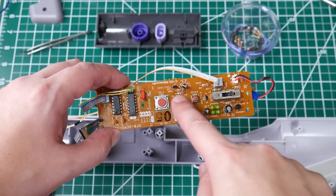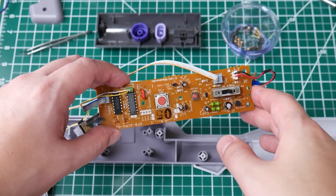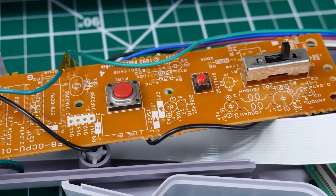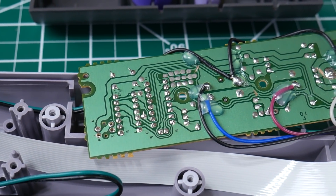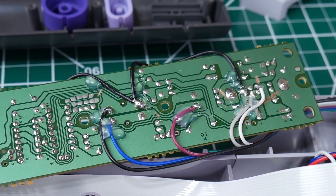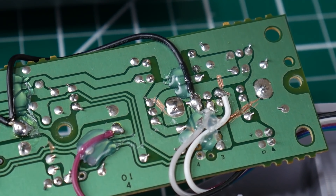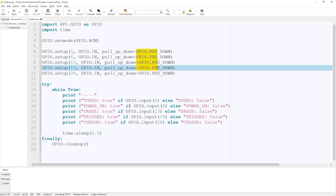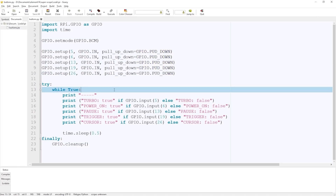With our LEDs, camera, Raspberry Pi, video sync processing, and Bluetooth all working, let's work on the gun's buttons next. There are three buttons and one three-position switch wired to this board, but we don't need the other components — we'll remove everything extra. We're going to use five GPIO pins on the Pi, with five wires connected to one leg of each button or switch. The other legs will be connected together and tied to 3.3 volts with a current limiting resistor. I've also isolated the switches by cutting some traces, scratching the copper off with a screwdriver. On the software side, we're using the Pi's internal pull-down resistors, and the Python code displays button statuses every half second, printing true if a button is pressed. It works — notice the first two lines are the turbo and power-on states; whenever turbo is true, power-on must also be true.